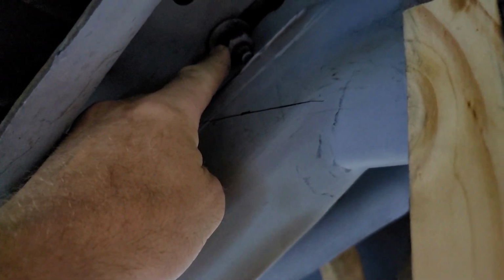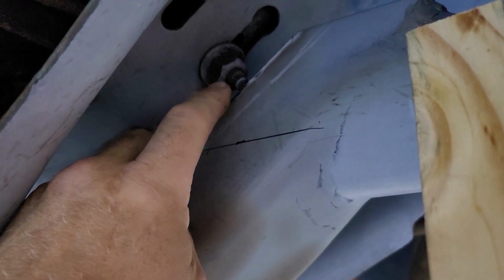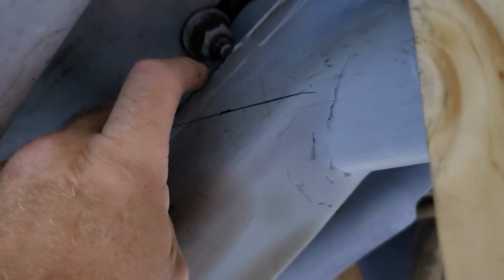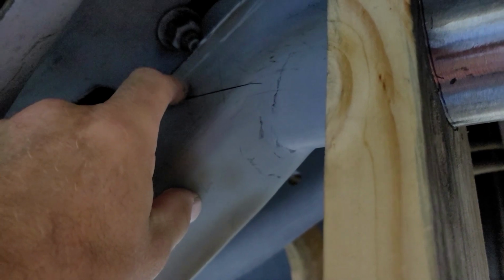That guy right there. Right now the top of the axle is hitting that because you see those white marks. That's where I've got to cut it out to clearance, from before we went through that a long time ago. So what I'm going to do right now is mark around this with a pen, and cut this guy out just enough so it'll clear, and I can let this thing all the way down so I can make these bag mounts. Once I pull the axle out to final weld everything up, that's when I'm going to extend and come across here and rebuild this side up for where I had to cut that area off of it over here, and we'll make a nice cutout spot for that stupid bolt so it can clear properly.